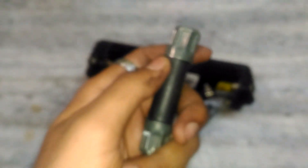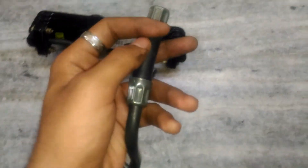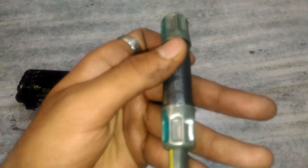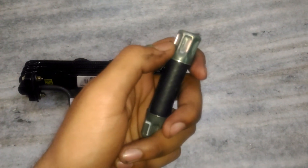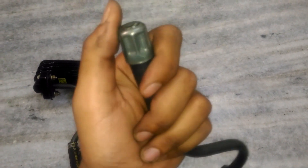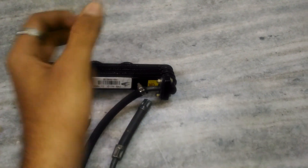After inserting the hose into the metal tube and crimping it with the stainless steel washer, if you are not satisfied you can apply a bonding agent like Fevikwik or 55 Quick in between the metal tube and the hose to avoid future oil leakage. The stainless steel crimping is just an additional measure.